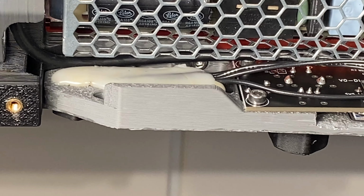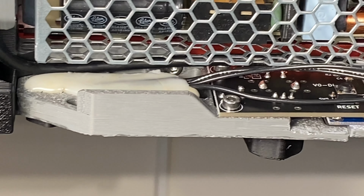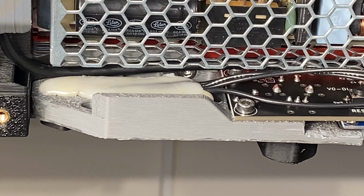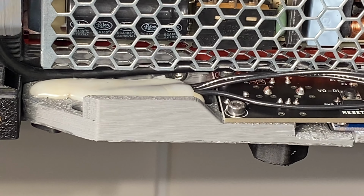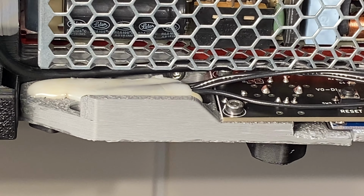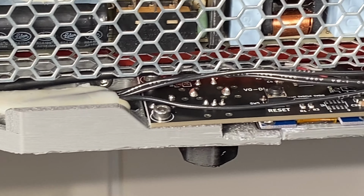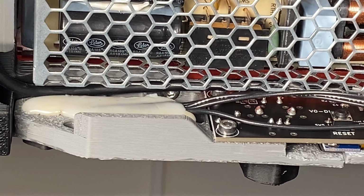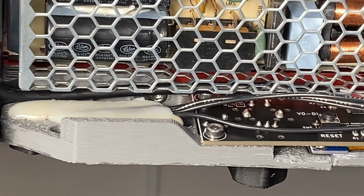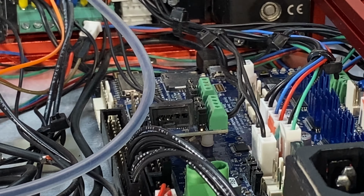So for the buttons, unfortunately, there isn't much you can see because it's hidden behind hot glue. The reason for that is if you don't do that, you're only relying on the solder on the legs of the tactile switches and the wire, and that's kind of weak, and I found that those can come loose. So I like to use some hot glue. But basically, if you want to know how this is wired, one pole of the tactile switch is connected to ground, the other one is connected to a GPIO pin, and they're all running to the Duet Wi-Fi here.